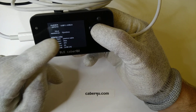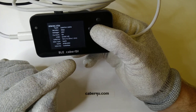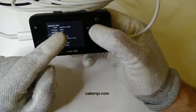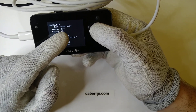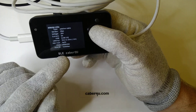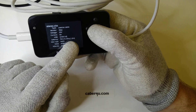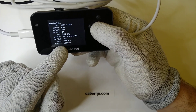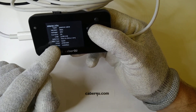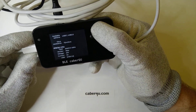The VBUS resistance is at 72 milliohms, which is quite high but still reasonable for 2 meters of length. And now we can see it's actually an e-marker cable with an active chip inside — vendor ID is 05AC, confirming it's an Apple cable — rated at 20 volts, 5 amps, and USB 2.0. The latency is between 10 and 20 nanoseconds, which corresponds to approximately 2 meters or less. Apple is already at hardware version 0A, so there seem to be quite a lot of versions of this cable out there.